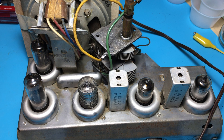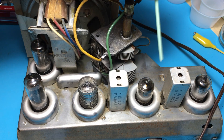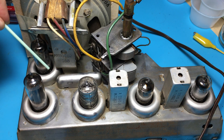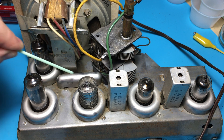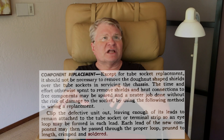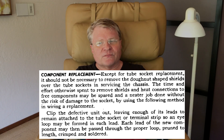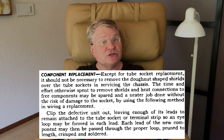On the top of the chassis, around all the tubes, there is a circular donut protecting the connections, and there's also a couple-inch-long rectangular piece in the same mold — so everything is being attached on top of the chassis. As I got into it more, even though J-hooking was working fine and that's what the technical information from GE says to do, I decided that for complicated connections where five or six wires come together, I actually did want to unsolder them up on top. So I finally got the gumption to pry one of these aluminum shields off.